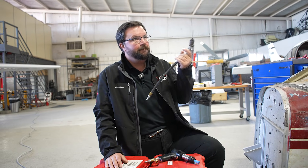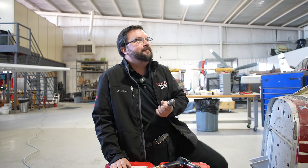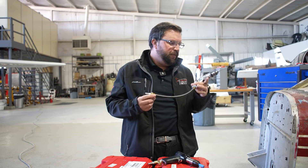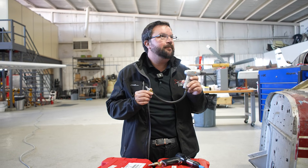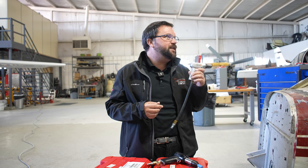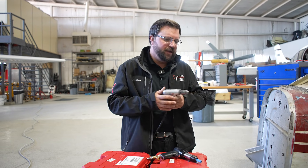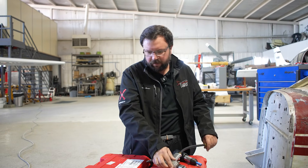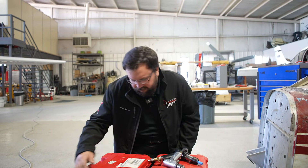How do we drill aluminum? Fast, low pressure — more importantly with an air drill. This is the best way to do it. Now modern electric drills will run fast enough, it is possible to do it, but I'm going to highly recommend using an air drill for better quality drilling.